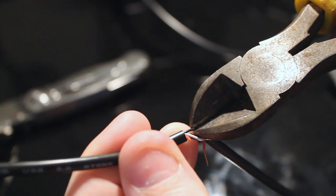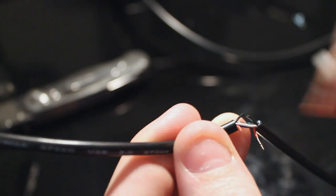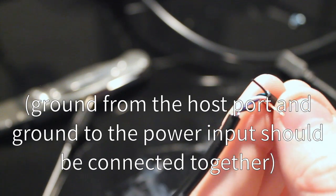So you're actually going to need to clip it in the middle-ish, maybe further in, whatever, because you will have to fuss with it. You're going to have to reconnect it back to the other wire, which is why I'm reluctant to do this, but whatever. So, I'm going to use my strippers for my wire wrapping tool. Shove that in there. I guess I need some pliers to give it a good old bunch. You get a wire wrapping tool at Radio Shack, which is where I got mine. But Radio Shacks don't exist anymore in most places, so you are probably out of luck. But if you have one, wonderful.